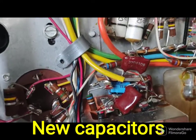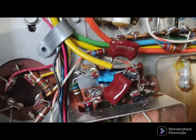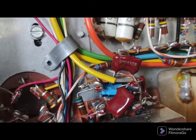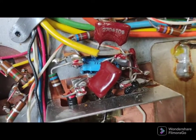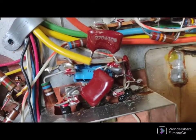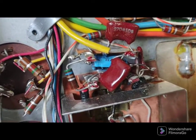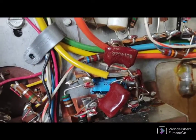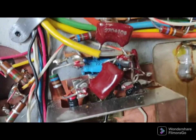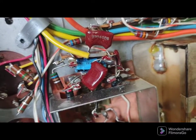Just to show you the repair — I didn't have a 25 microfarad, so I used a 22 in parallel with a 4.7, which gives you 26.7 microfarads. These are also 50 volt capacitors, where the original was only rated at 25 volts. This is RF, so I don't know — the old cap certainly could have measured 26.7 microfarads. Hopefully this won't throw off anything critical as far as the alignment.